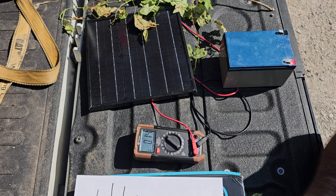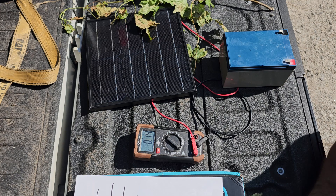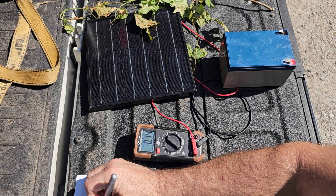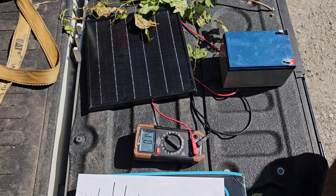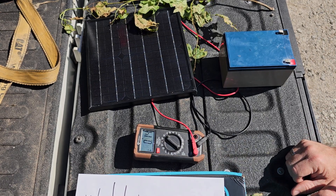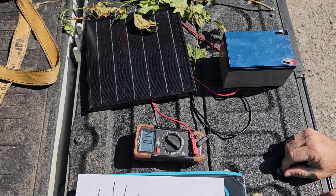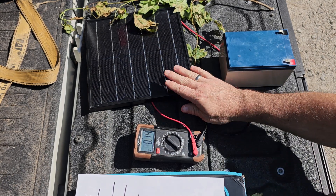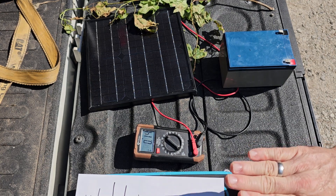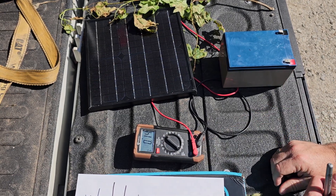Let's see where the rubber meets the road. 21.5 times 0.46 equals 9.89 watts - it was over 10 just a while ago, but the sun is going down. Earlier it was 10.5 and then about 30 minutes ago it was 10.1. As the sun goes down it gets further away and you have less solar output. When they rate these panels they rate them at 'high solar noon' - when the sun is perfectly directly overhead, the panel perfectly facing it, with minimal dust in the air.